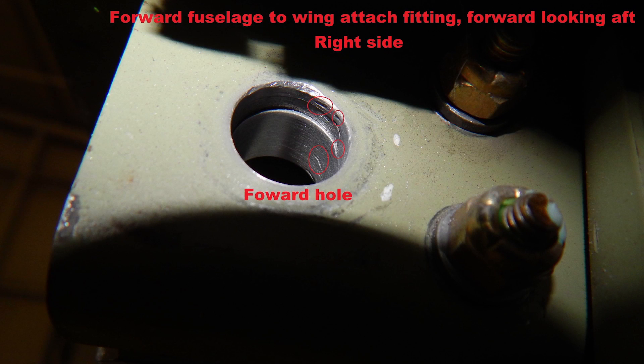Keep in mind that corrosion could be on the inner walls of the bore as well. This is often more discoverable at fastening locations with a longer grip length, such as locations through a forging, spar cap, or other thick principal structure. In order to clear the hole of corrosion, it is often necessary to ream the hole site to clear any pitting the corrosion may have caused to the bore.